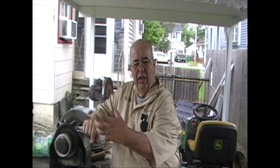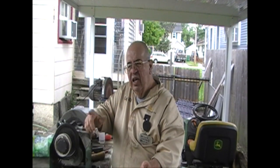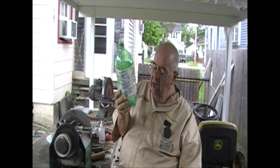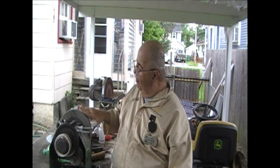It's got a buffing rig. It's got another little collar that goes on with it that lets you buff. I use their product for lapping compound, but I found that the automotive lapping compound for polishing works just as well. Always keep it wet. If you're going to use it later on today, and you haven't used it in a couple of days, get your 2-liter bottle of water, no soap, nothing else, water, and put your water in it, turn it on and let it run for about an hour. It'll load that stone with the water. It'll help you when you're grinding, and when you get ready to go, you take your dressing stone, clean off any surface blemishes and stuff, and make it slick as can be. Remember, these cut so simple, so easy. That's all, just remember that.